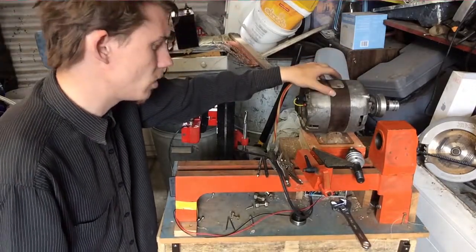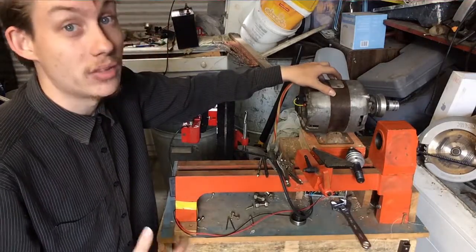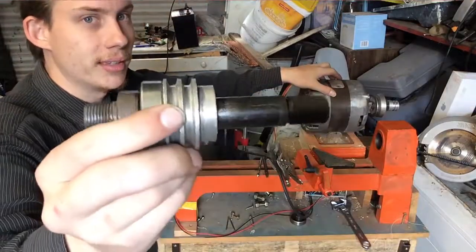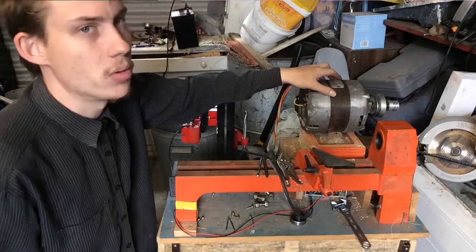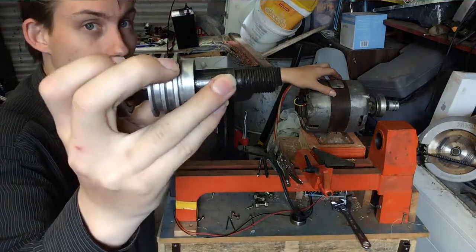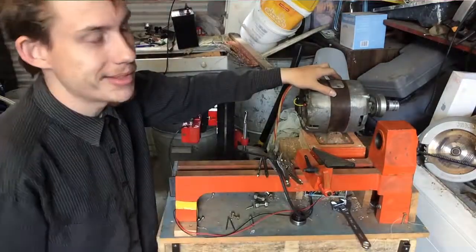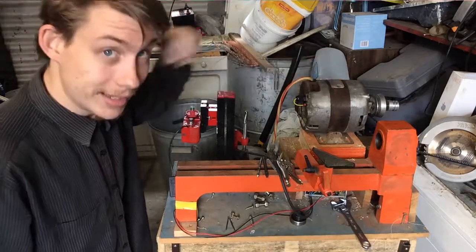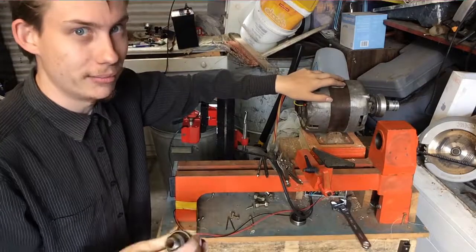The plan at this stage is to use some very oversized O-rings as the drive pulleys, because trying to find a V-belt that fits is pretty much impossible in the small town that I live in. The bottom of that V-belt groove is 4mm across and the top is only 6mm across, so trying to find a V-belt of the right length and size is pretty much an exercise in futility in most parts.